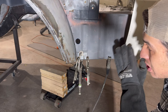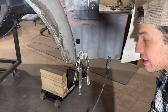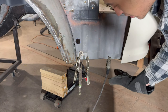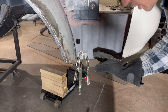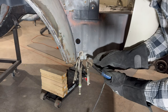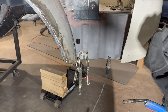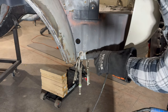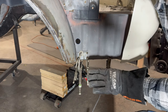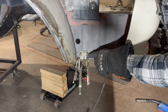To get things started, don't just go ahead and start laying welds down. Tack it in as many places as you can and make sure everything fits up as flush as physically possible — that's the whole objective with OEM-style repairs. Make sure you're grounded up to the metal you're welding. For the tack weld, just quick and light — you don't want to be super hot and heavy, just a nice quick adhesion. You can feel it's fitting up flush, so we're off to a good start.